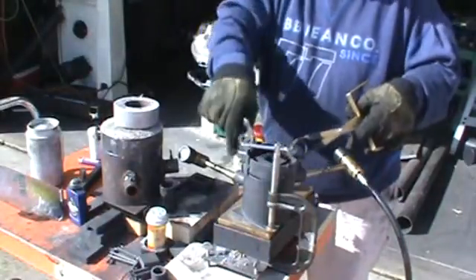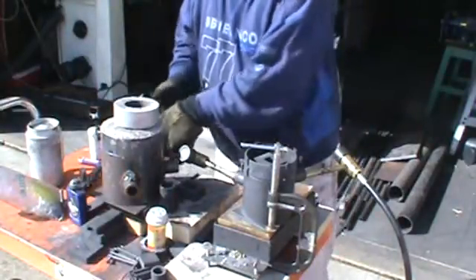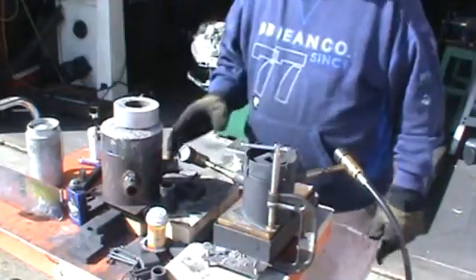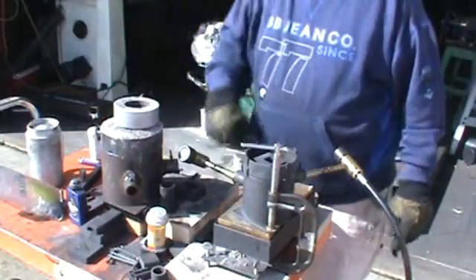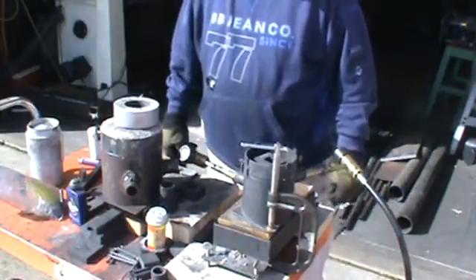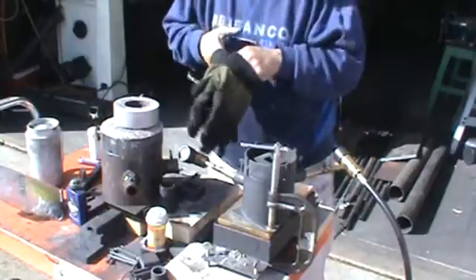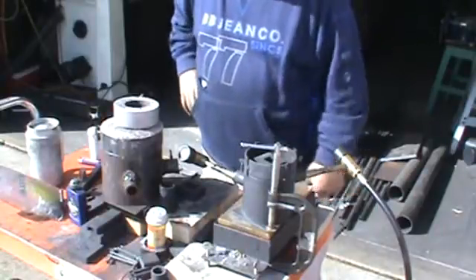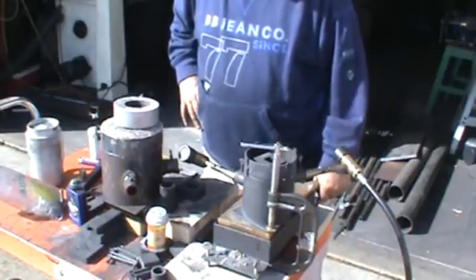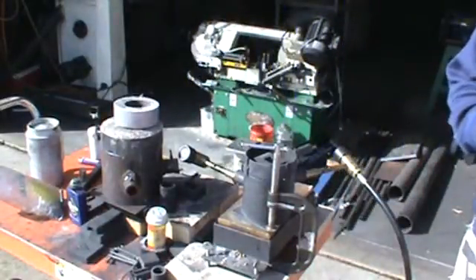So anyway, that's the new clamp and a little expander for the Micro Mini, and it works great. Also, when you get your mold — even if your mold isn't real hot — if you get your metal hot and pour it in one motion, you can pretty well fill vertical pour molds without it setting right in the sprue cone. So that's the two-part clamp in use in a furnace. I poured the other video with Babbitt or Pewter — love that word, Babbitt. This is how it works as it's functioned with a gravity mold in a furnace, and that's enough for now.